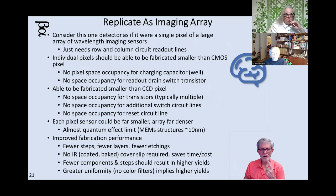We've seen one triangle. If you make the triangle really, really small, it'll work for photometry. But if you can reproduce lots of them and hook up all the wiring, you could make an imaging array — you wouldn't need any Bayer matrix filters on top of them, and you wouldn't need any capacitance wells to build up an exposure because it's direct reading. That would allow you to make pixels that are denser and smaller than CMOS — probably four to sixteen times more pixels per square millimeter.